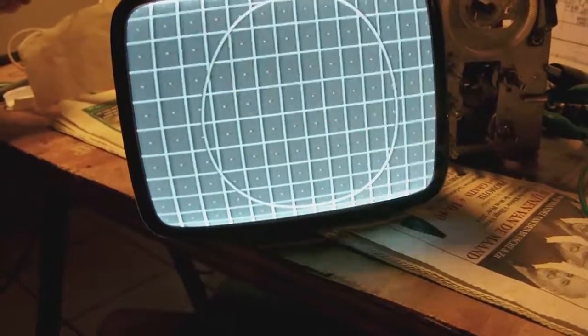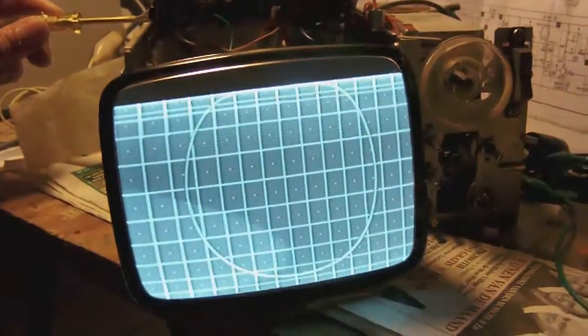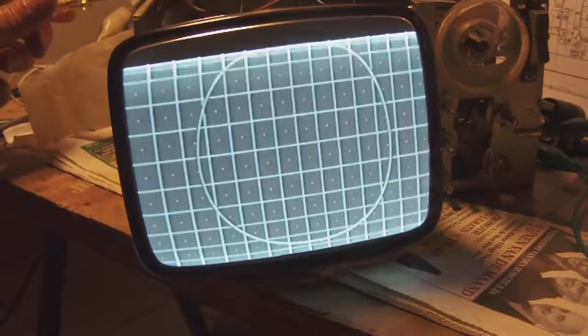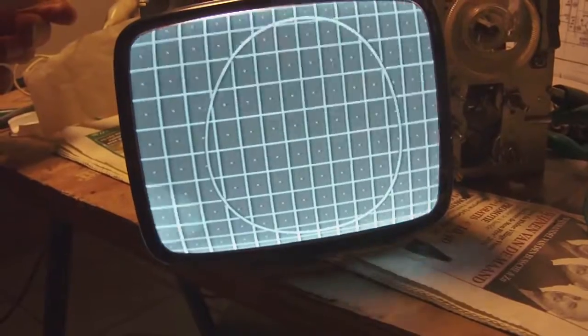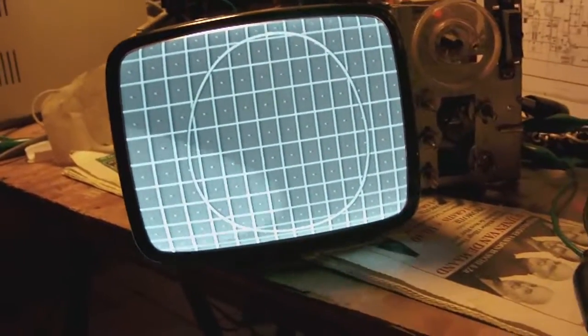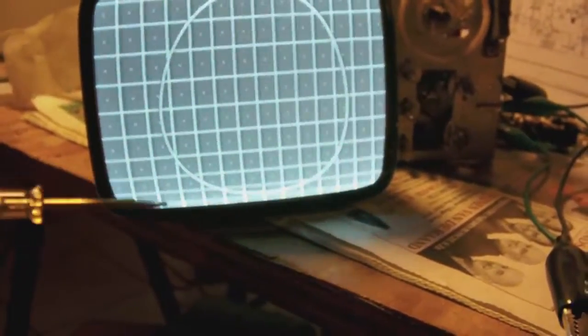I can compensate for the compression on one side and the extending on the other. I can up to a certain degree, but as you can see, the picture starts to roll over itself as I do, which is of course not a desired effect. So if I extend the linearity to say this, then the picture is still deformed a bit, especially at the bottom, but basically, you could say the image is rather sharp.